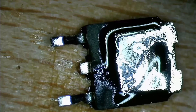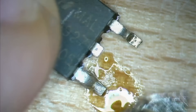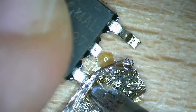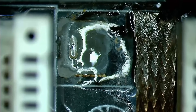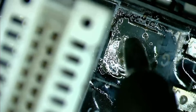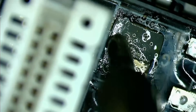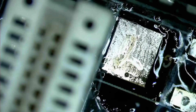At least this looks decent again. We also need to clean the pins from the low melt solder — you don't want this mixed with the fresh solder when we return the component to the board. And of course, we also need to clean the pads. There is some low melt solder residue which should be removed before we reinstall the IC. The solder on the large pad seems to be corroded as well. I got rid of the old stuff using a solder wick and several rounds of applying fresh solder. This big pad is a connection to ground, so the IC was not properly grounded and as a result didn't function as intended.